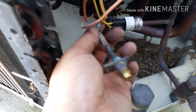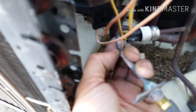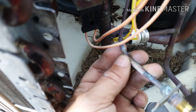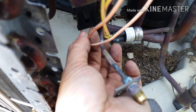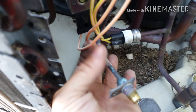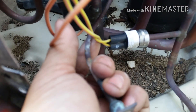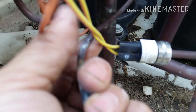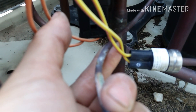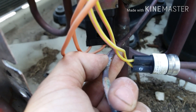See our true suction port - you can see our reversing valve wires. The reversing valve wires look like they rubbed a little bit. There is a nick in one of these wires but it hasn't rubbed through the insulation, but this is the larger one - that spot right there. The camera wants to focus on everything but this true suction port - there you go, see that spot right there.